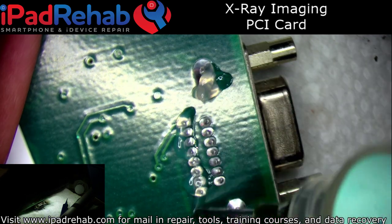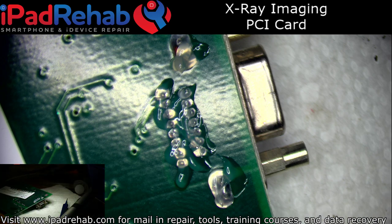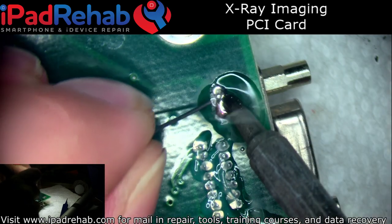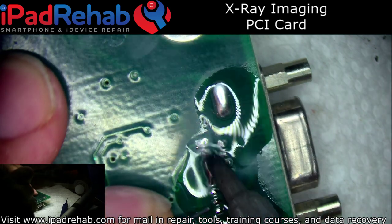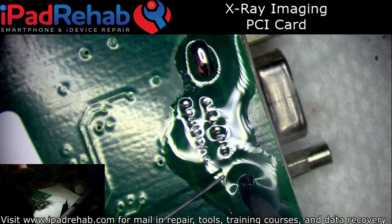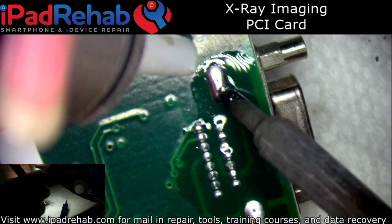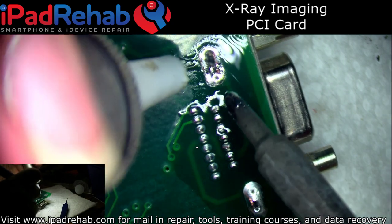let's get started. So I'm going to begin by adding some leaded solder to these joints. I don't know if they're made with lead free, but I'm going to assume they probably are, just like everything that was made after like 1990, whenever. So just gonna flood these joints with a nice bunch of leaded solder. All right, now let's get in here and suck some solder. Sweet, love that.